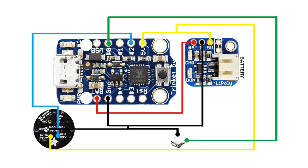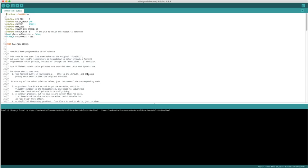The switch is on the green line going to pin zero, so the program knows the switch is on pin zero. If you put it on pin one, you'd just change your code to pin one. The other contact on the switch connects to all the other grounds — that's what turns it off and on. If you connect all this together without any code, nothing happens. You need some type of Arduino programming to make this NeoPixel work. There's a link in the show notes to the GitHub where you can find the actual code I used.